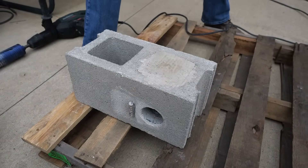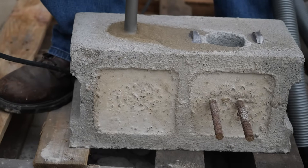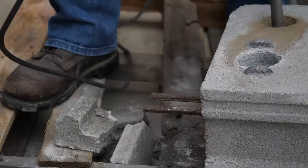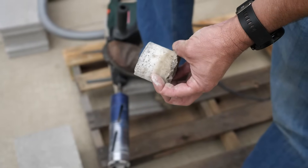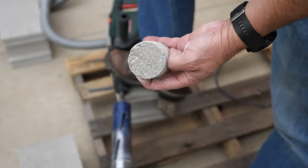But that isn't the only benefit with diamond coring, as you'll also gain quality. Often the pounding of the hammer drill has some not-great consequences on the back of the hole — it'll blow out and you'll have a mess. Running utilities into someone's finished basement, this is not a great look. With a diamond bit there is no pounding. Since you're grinding, you'll get a nice clean core without the risk of blowing out the back end.